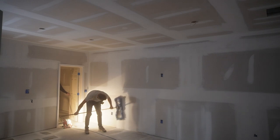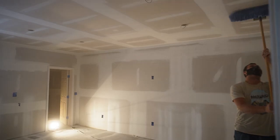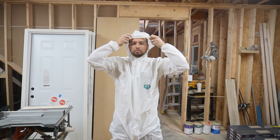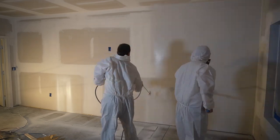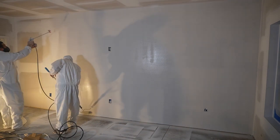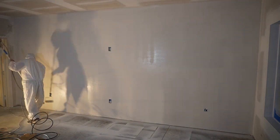Now that was the last thing before painting. After all the drywall, there's a ton of leftover dust that needs to be removed for the paint to go on well, so I used a dust mop. To paint this apartment, I used a Wagner Control Pro 190. The tip it came with was a 517, but it was leaving streaks, so I switched to a 515 tip and had a much better experience. My father-in-law was back-rolling behind me after I sprayed, which ensures the primer really sticks to the drywall.